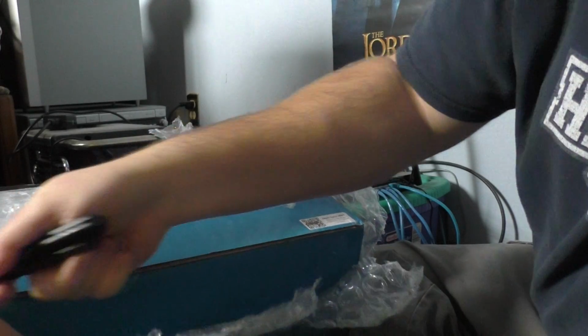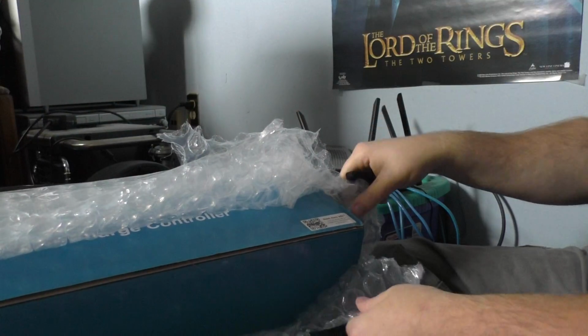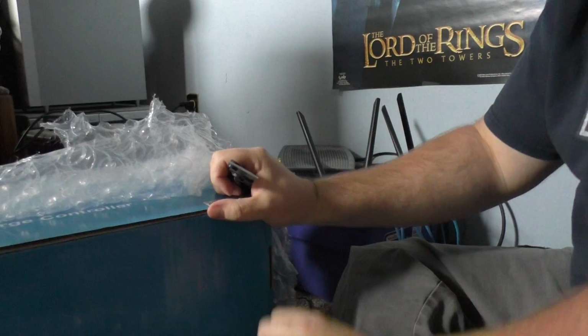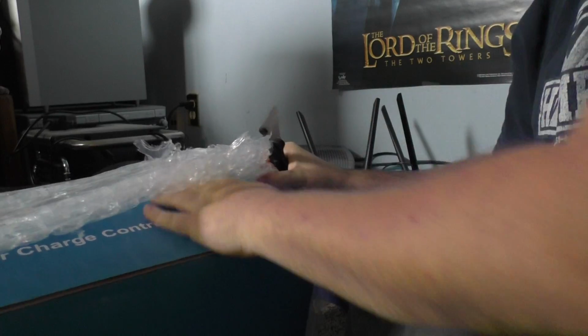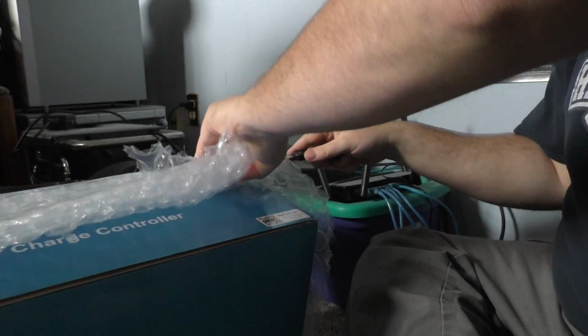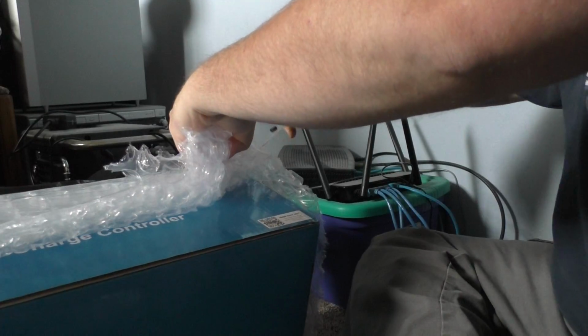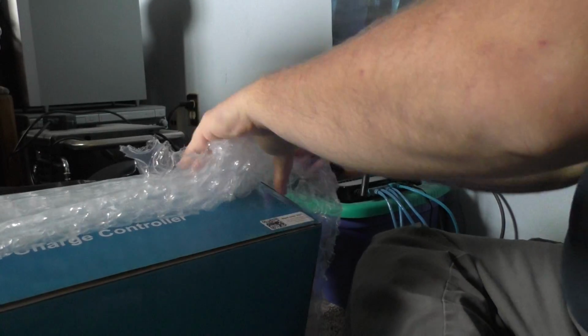And for those of you who don't know, a charge controller, especially one this good, this one is an actual MPPT charge controller. What they do is they squeeze like an extra 30% of power out of your solar panels, and it's highly recommended for my area winter use, because in the winter time my little black PWMs that you saw me playing with in the power pack would be okay if you didn't have anything else, but in the winter time they probably don't produce for you, whereas this one will, even on the most overcast days, which is kind of nice.